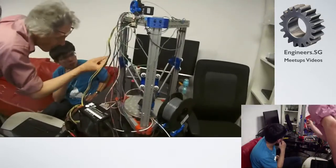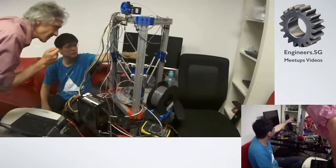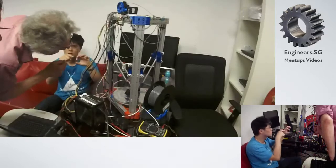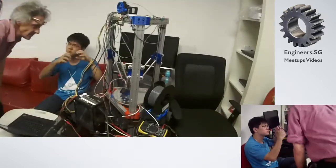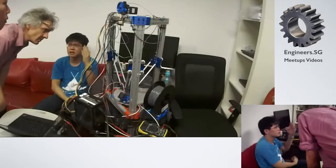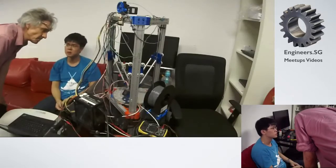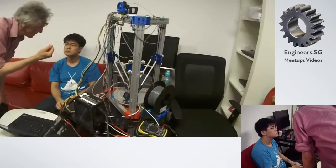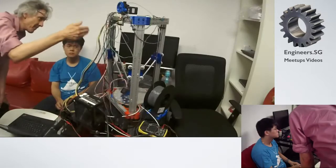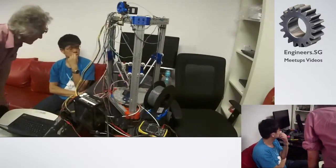So these ones, you designed this part, this one, this part. Yeah. So how many microns does it do? How much play? It's adjustable. So you see these, they're hexagonal spacers, right? These are eccentric spacers. The hole is not in the center. So as you turn the spacer, it pushes the wheels against each other. It's a bit difficult, but you have to adjust both spacers in tandem so that you keep the carriage centered. The eccentricity is 1 mm, so you can adjust it inwards by up to 2 mm. But when you move something down, how much wiggle room do you get? I don't think there's much.